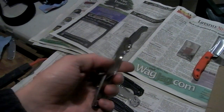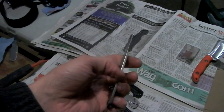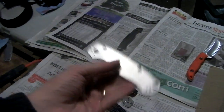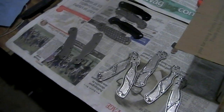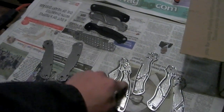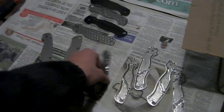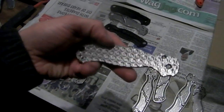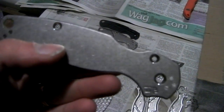A lot of times you get chatter on the walls, and if it's not chatter, then it's just kind of like waviness. I did not get that with these, and I'm super, super happy. So they didn't actually need to be tumbled. I deburred them very well on the machine. I cut almost every sharp edge. But then we Scotch Brited the edges and stuff. But to get this crazy awesome finish, they just had to be tumbled.